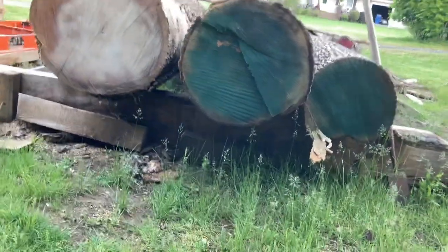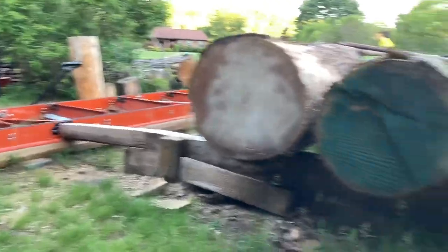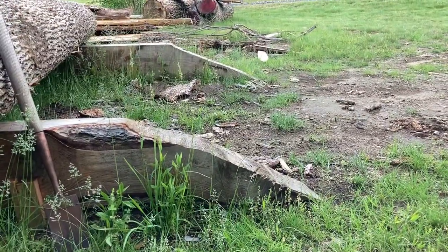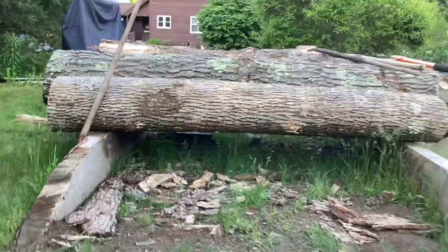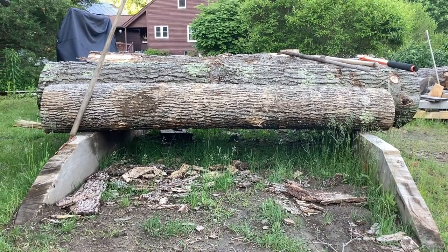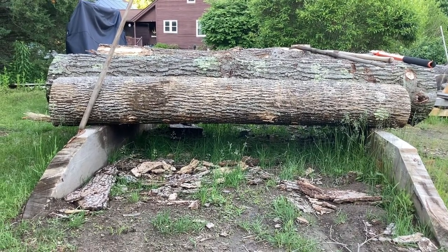And so like a chef preparing his work on the counter, I'm ready to go and move my material easily to the mill. Additionally, I would suggest a little 45 degree chainsaw cut at the back end and spacing them just wide enough for the front tires of your tractor to pull in narrowly in between, so that you can get in nice and tight and still control the log and not just have to roll it from a distance.